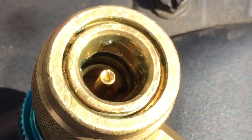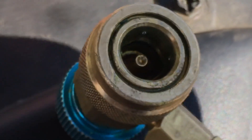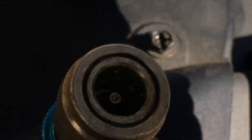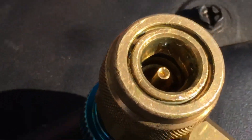Let's see if I can get it — you see it starting to approach right there? See that black o-ring? You want that coated when you have a rough surface on your coupling fitting on the end of your hose, and you don't want to scuff that o-ring and you want to make sure it's a vacuum-tight seal. Just put a small amount there and it'll finally go down the cylinder and go on top of that o-ring — but you have to wait until it hits the o-ring.